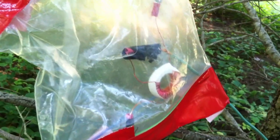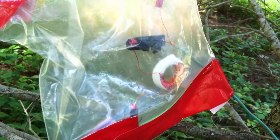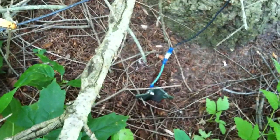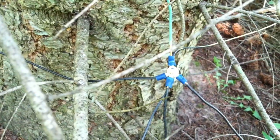I have my FT-114 toroid with 44 to 6 turns. The green wire going down here goes to the ground. I have five grounds which are one-foot aluminum tent stakes — there are five of them, one at the center and then radiating out to four other spots around this tree.